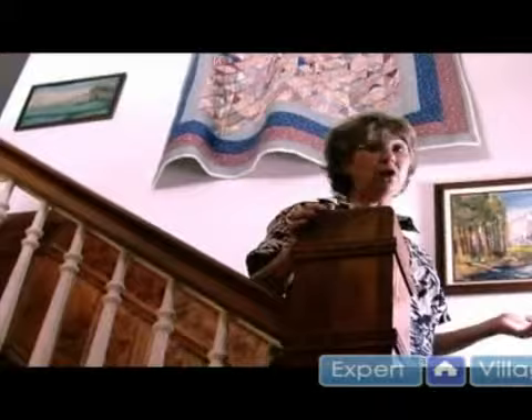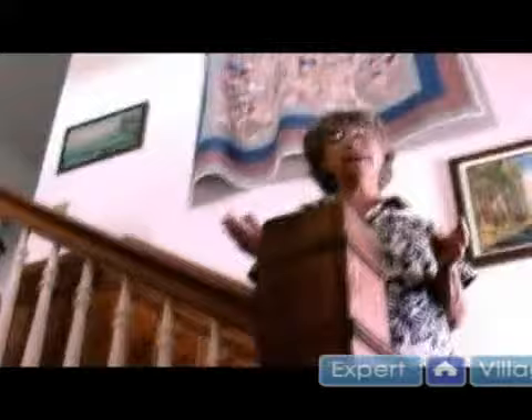So if you move into a Victorian house, chances are it has been painted. Don't be afraid to take the paint off. The main thing is you have to get the stripping ingredient and leave it on at least 45 minutes. I made the mistake of not leaving it on long enough, and therefore I had to use many, many cans, and it took longer.